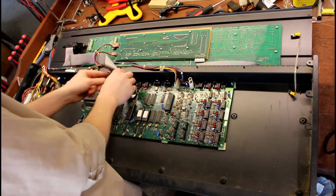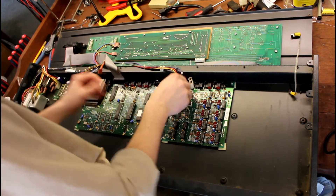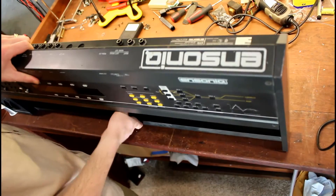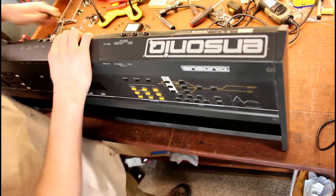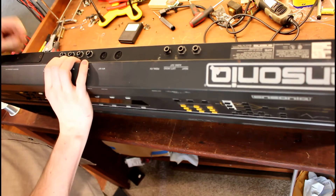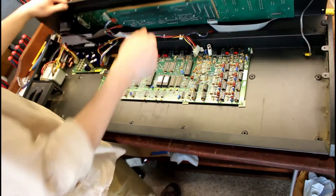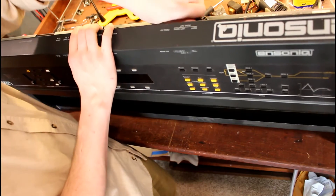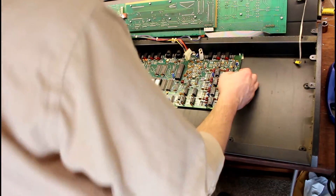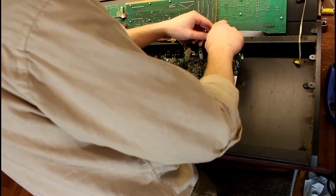Alright, now that we've got that removed, we'll go ahead and remove the other connectors from the main circuit board. You'll also need to come around to the back side. If you've got a sequencer expansion card, there's a little cover right here that has to come off — there's two screws for that — and it should pop right out. Then you also remove the seven nuts on the IO jacks, and then there is one screw on the main circuit board up here.